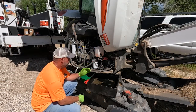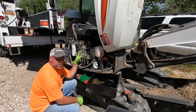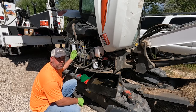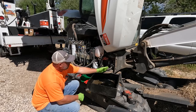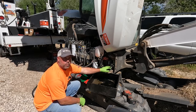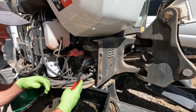While I've got the hydraulic oil pumping out, let's talk about how to drain the coolant. The radiator and everything is over here. I already took off my radiator cap — the machine wasn't hot, I just warmed it up a little bit enough to get the oil warm — and I released the pressure on the radiator just like I did on the hydraulic tank. If we follow our lines down here, this is our heater control valve, and right here is a connection — this is where we're going to take this hose off and drain the coolant.